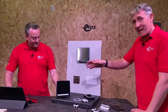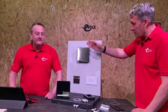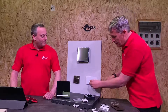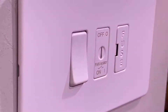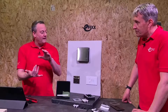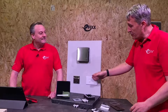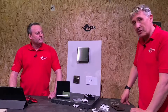I've paired this with some Knightsbridge fans - they also make fans in coordinated colours to match the range. There's a nice black one as well. Black is apparently one of those on-trend colours right now - it is the new white. You've switched the light on, the fan's come on, switch it off and as expected there's the run-on timer. In a hotel room you can't switch it off, but if you want to do maintenance you've got the secret key switch to isolate it, operating all three poles. That is tiny and really clever - great for rented properties and hotel rooms where you really want to leave it running.